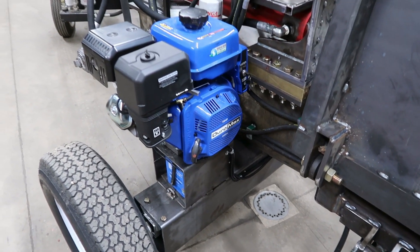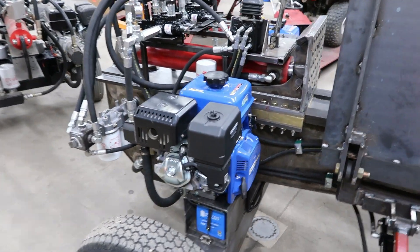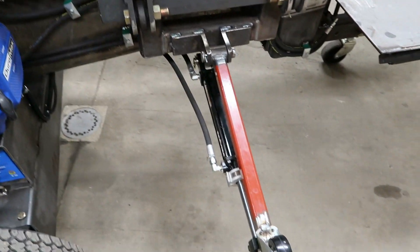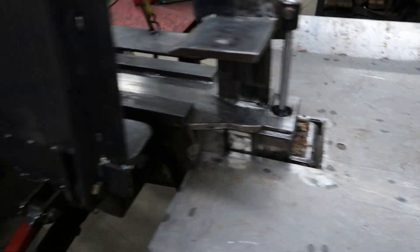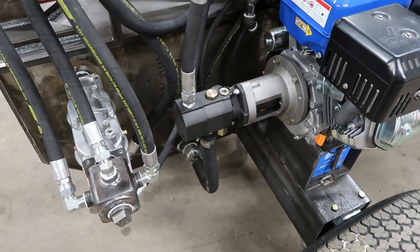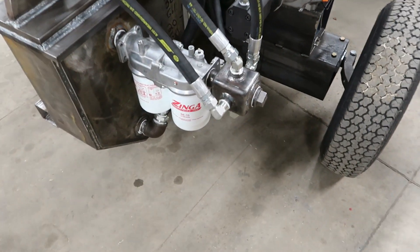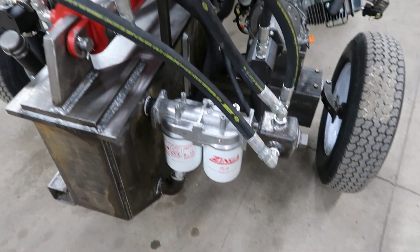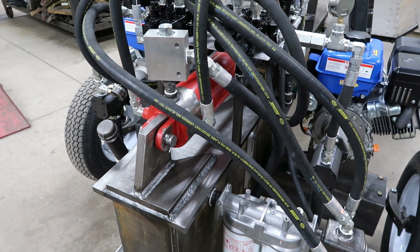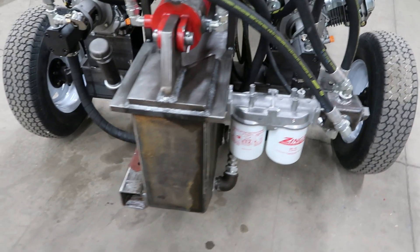Here's the secondary engine — it's identical to the primary. There's the four-way valve feeding the log-lift cylinder and the wedge cylinder. These are 28-gallon-a-minute pumps, same on both motors. There's a dual tandem filter setup. Most of this came from Surplus Center, except the dump valve which came from Split Easy.